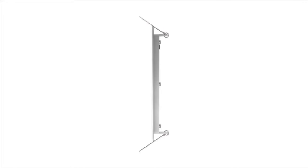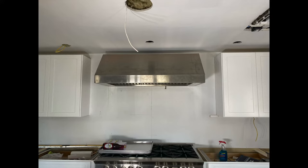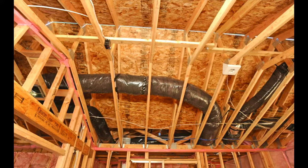First thing is they're paper thin. I can't tell you how many times I've been called to a job where there's a joist, ductwork, or something stuck right where I designed the lights to go. With recessed cans you have to move them — they have depth — or you go for a shallow housing which usually doubles the cost. With wafer lights being as thin as they are, you can put them wherever you want. Under ductwork, in a basement, wherever there's electrical or plumbing. It's a home run.